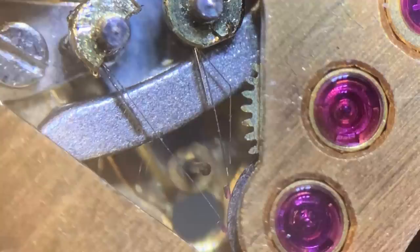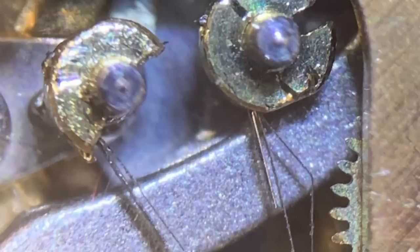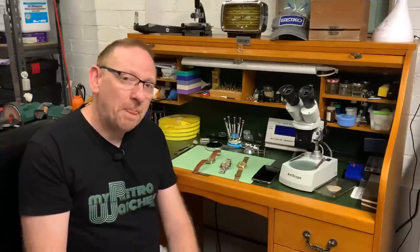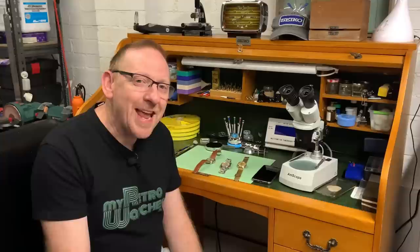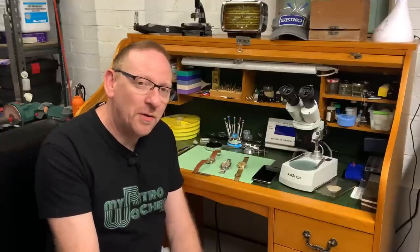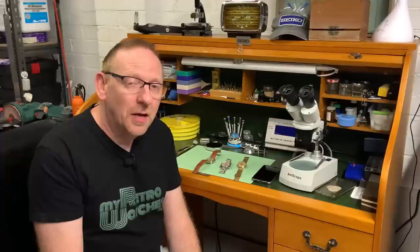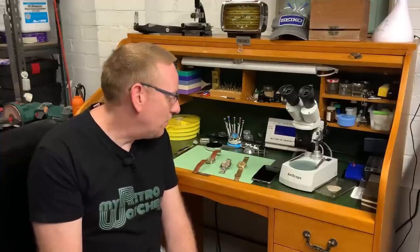Sadly it still didn't run properly. I looked at the index fingers — they have little collets on them to hold them in place on small posts. Both collets were fractured to start with. When I was reinstalling them, one broke when I was moving it and the second was so badly fractured that the watch wouldn't run at all. So I thought, I'm not going to give up — I'm going to try and find some fingers and a donor watch.